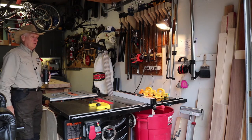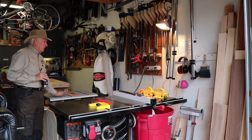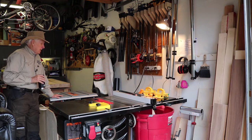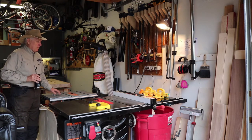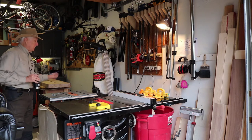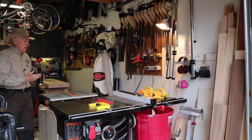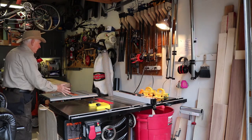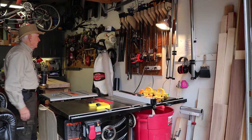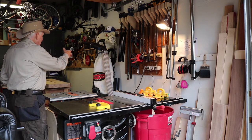The concept I use is my contractor's saw — which is what I had before the SawStop — with the dado blade left on it permanently. The contractor saw becomes my outfeed table for the SawStop, and the SawStop becomes the outfeed table for the contractor saw. If I'm going to put a big sled on here I need to just pull the contractor saw away a little bit so my sled doesn't get bound up. I want these to be level.